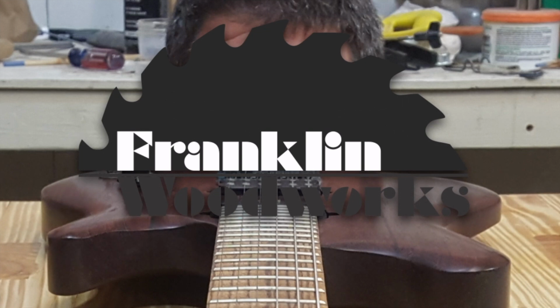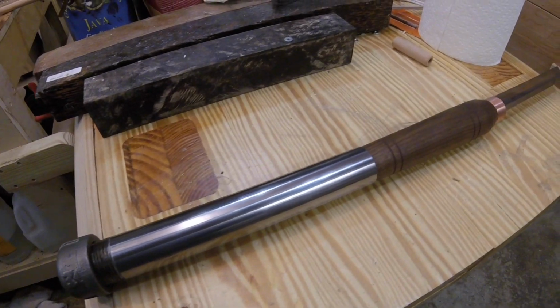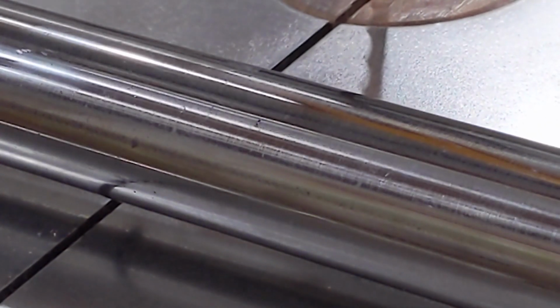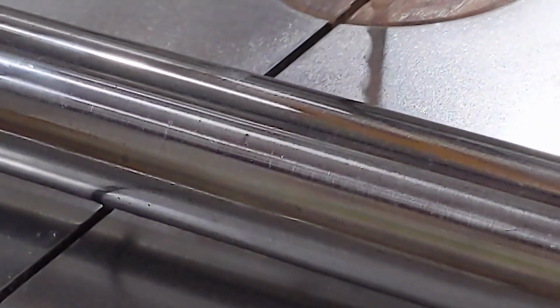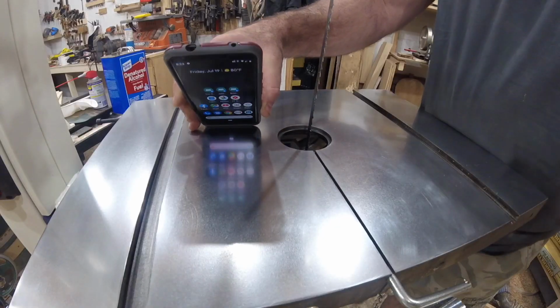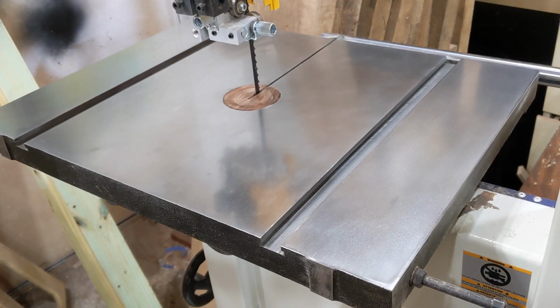Well, it's on now. Remember I had a commenter that told me his polished hand planes were the ones that didn't rust? And that he reminded me that I had a lathe tool handle I polished 21 months ago and hasn't rusted in spite of being in my sweaty hands for hours? Well, that caused me to polish my bandsaw table as an experiment. I went up to 2000 grit paper, and this piece of cast iron is shiny. But it has a lot of pitting due to past rust issues, and that may ultimately compromise the test. But that was 10 days ago, and I've got not the slightest hint of rust so far.